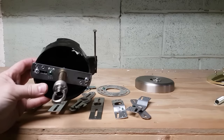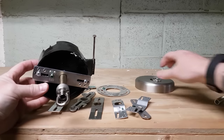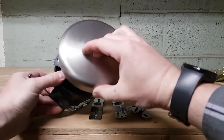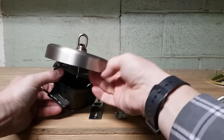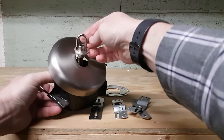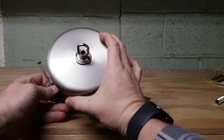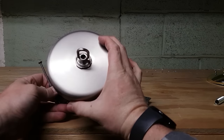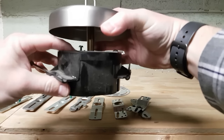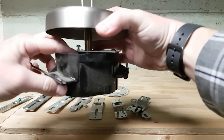When the fixture is mounted, you may have a center hole like this canopy does. This canopy has a center hole that mounts over and then has a retaining ring that mounts over the loop. When assembled on the ceiling, the strength comes from this 1/4 IP rod going through the threaded tap of the crossbar as well as a nut on the back side.